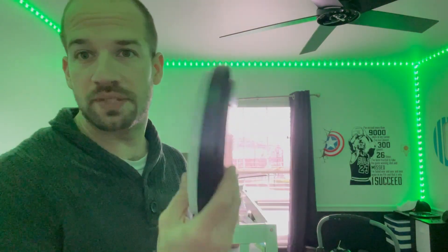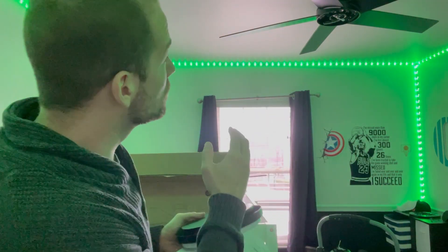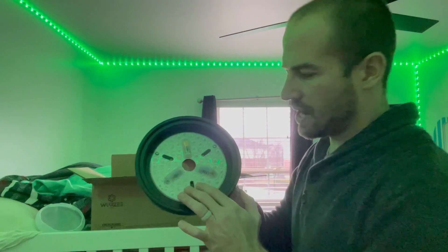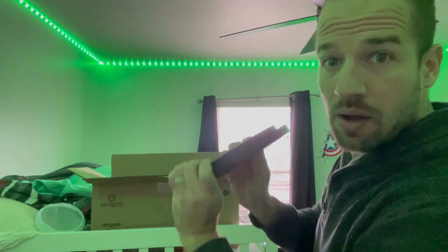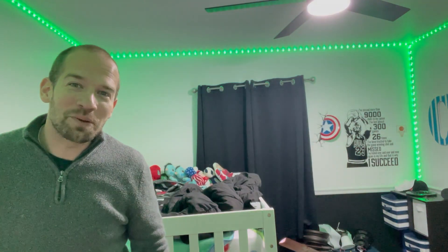Now that all the blades are up with three screws in each, I'm taking the light. You remove three screws already in the base plate, untwist the light, and you're presented with the actual bulbs. When you put it up, you see those three holes — take the screws out, put it up, align, then screw, screw, screw, then attach the bulbs last. It's the next day — turn on the power, put the bulb on, go over here and say let there be light — and so there was. The fan is going.